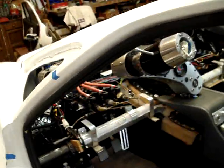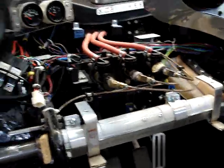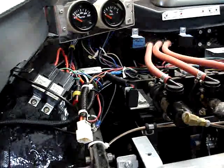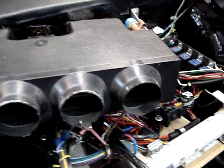There's been a lot of work installing the wiring. I took out dash panels and pieces here to show you what the wiring looks like underneath. Wiring's not totally done — it's not really bundled up and packaged up the way it should be, but I wanted to leave it at this point so that you could see what was going on underneath the dash. You see a lot of wiring bundles going through under the dash, and then over on the passenger side is the fuse box. It's right there in the passenger footwell, and I have it mounted to a little plate that folds down so you can access it from inside the car when all the dash panels are in place. That folds down and then folds back up — nice and compact under the dash.